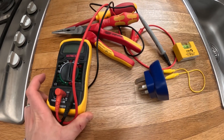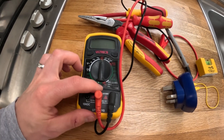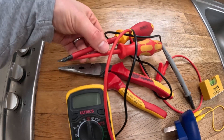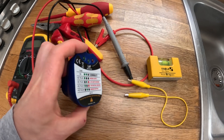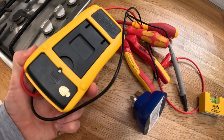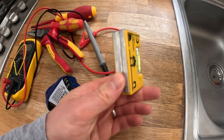It's a very basic toolkit today. I've got a multimeter — you shouldn't use this on the mains, this is just when it's turned off, I'm going to use this to find the fault. A pair of pliers just for moving wires around, long nose VDE pliers, a couple of screwdrivers to get sockets and things off, a socket tester just so I can see what's live and what isn't, a crocodile clip in case I need to link anything out when using the multimeter — obviously not to be used with any mains but absolutely fine with just the battery. And a small level so that I can get sockets back on straight. I'll leave the links to those tools in the description below.